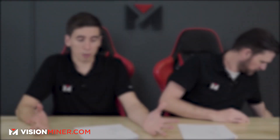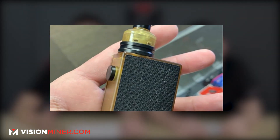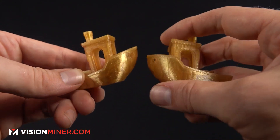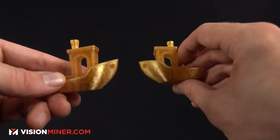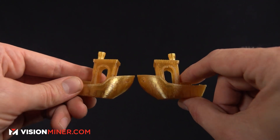It can be annealed. It's biocompatible for implants — that's actually a thing — surgical guides, medical tools. It is approved for food contact, which is why it's in a vape. It's an amorphous thermoplastic, which means it doesn't have a crystalline structure that would give it a melting point. It just has a Tg, and after that Tg, the mechanical properties are slowly going to fail more and more. The Tg on Ultem 1010 is 217°C — the second highest Tg of any plastic that we print.